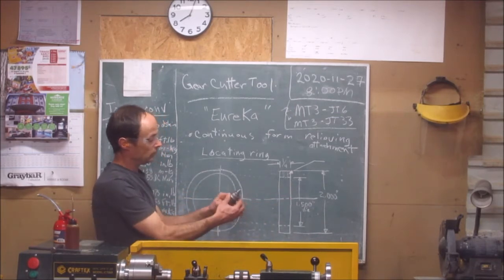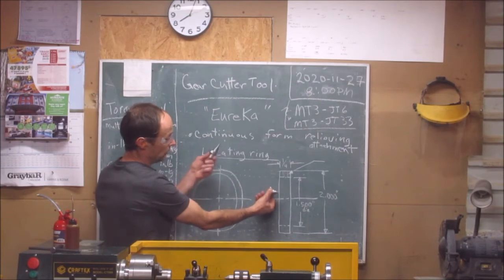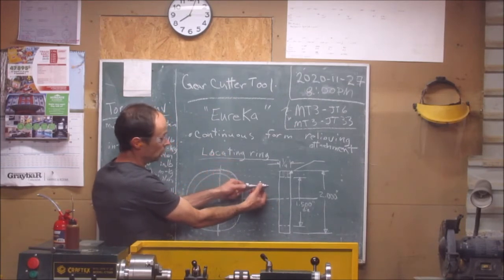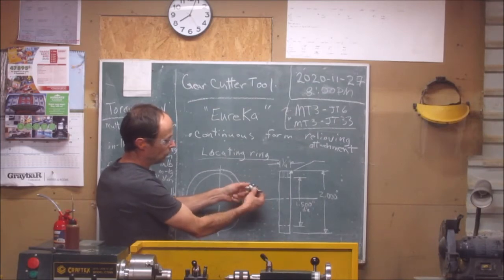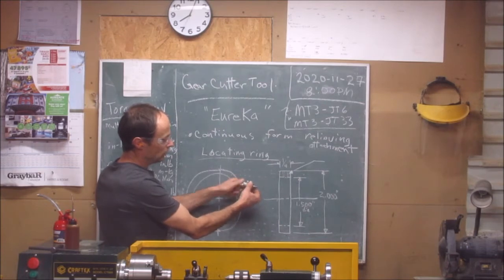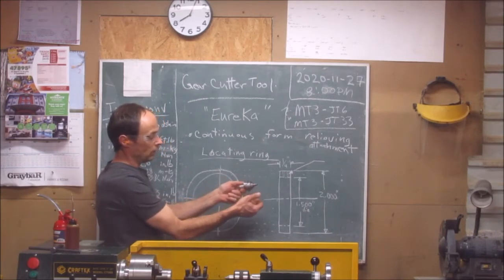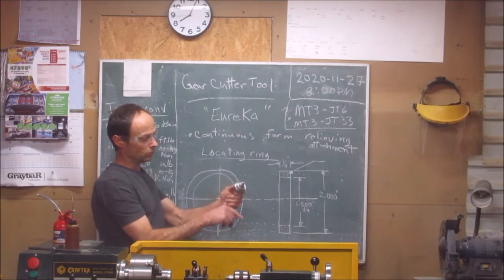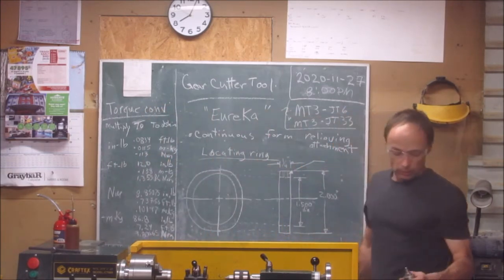And this is the indexing ring. I've finished it. That goes here. This is the mandrel, which goes in there. So this goes around ratcheting. As this cam wobbles back and forth, or in a circle, click, click, click, it does the ratcheting. Every revolution makes it click once. And there are 12 indexing grooves on here. So I'll give you a close-up of the finished part.